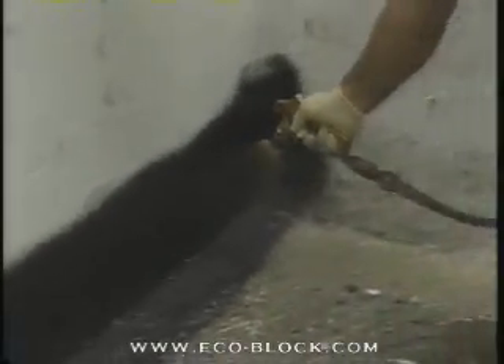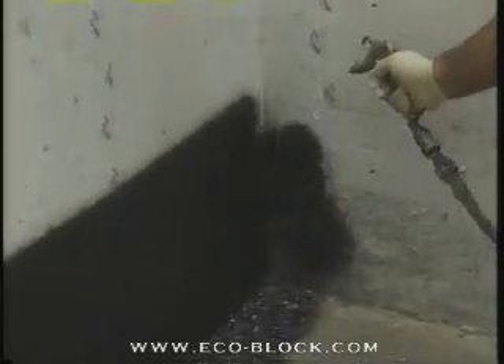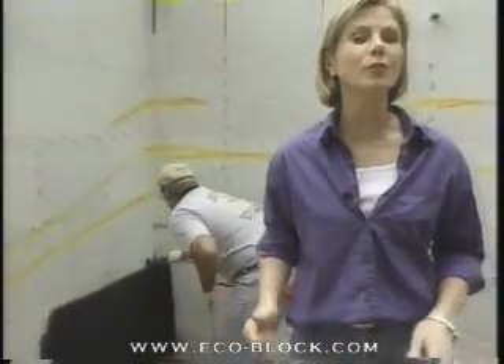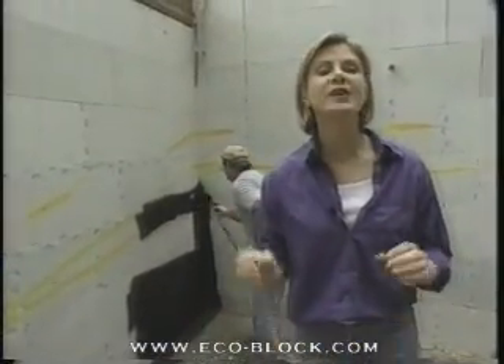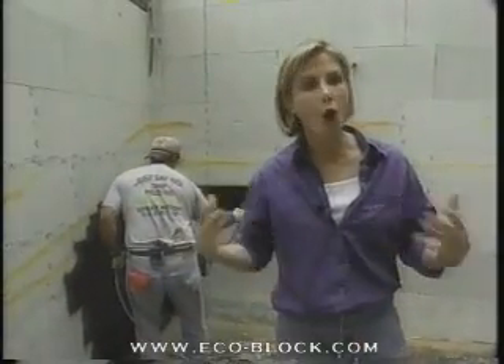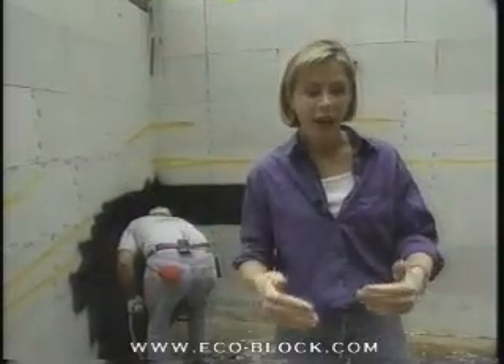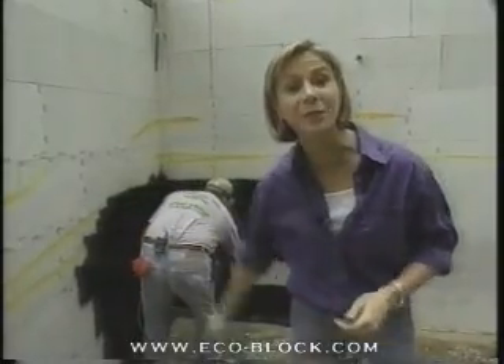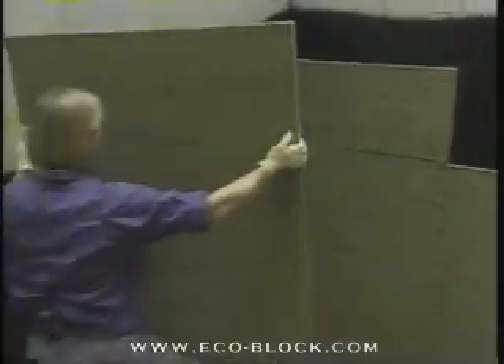What we're doing is putting down a waterproofing membrane — in this case it's called Mark Coat 5000. It is a polymer, a mix of asphalt and rubber mixed at a very high temperature and then sprayed onto these foundation walls. Now after one or two years your house is going to settle, and that means you could have some cracks in your foundation walls. This membrane will cover up any of those cracks to prevent any water from seeping through into your basement.